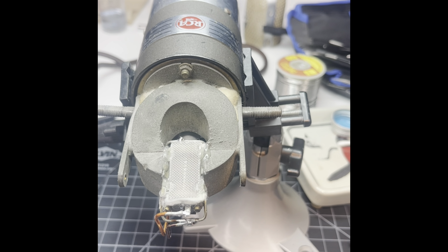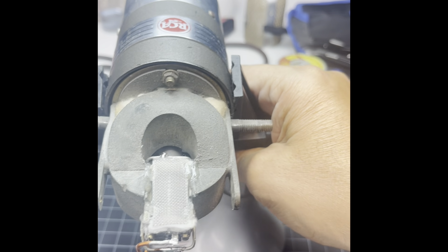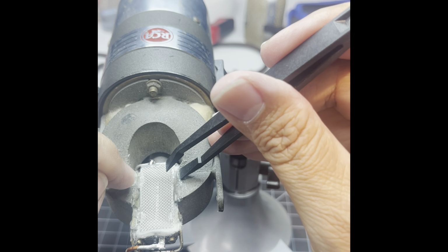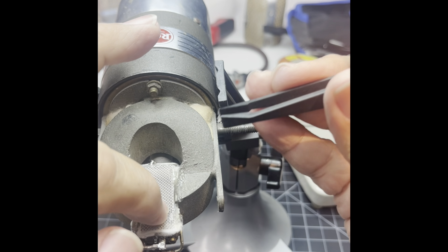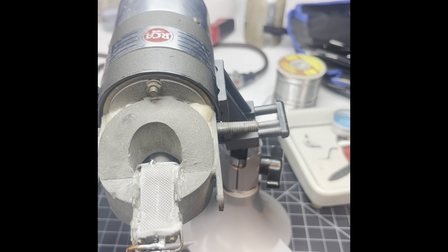Holy smokes. So as you can see, that's the ribbon inside there. And maybe make this a little bit, just kind of bring it into there a little bit more. Like I said, it's not a beauty contest. It has its function. I just don't want this to move. So the rubber cement will probably take, I don't know, maybe 24 hours to set up. So I'm not gonna necessarily be standing up this mic. I'm gonna let it sit and let the glue harden.